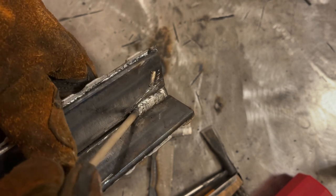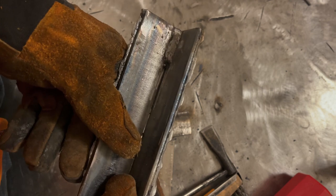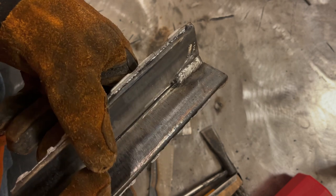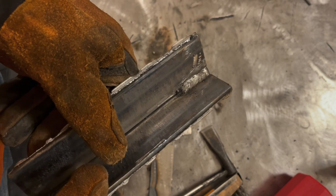but it's still just by visual while I was welding was not good. So what I would recommend in a situation like this in the flat position, not on a fillet weld, but on a flat position, is to downsize your rod by one size. So I'm running 1/8 inch here. We're gonna go to 3/32 size 6013. And we're gonna run that.